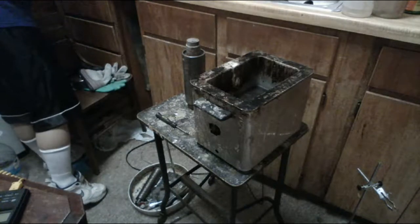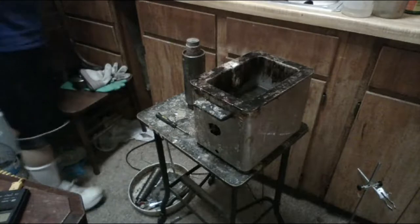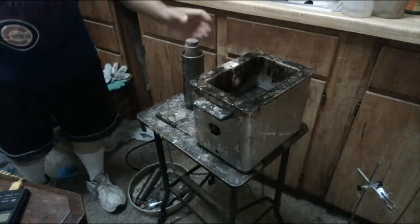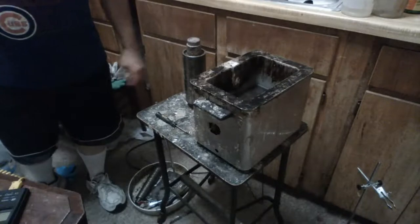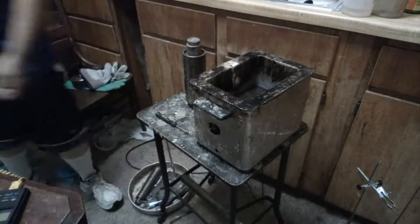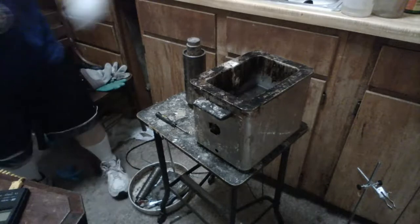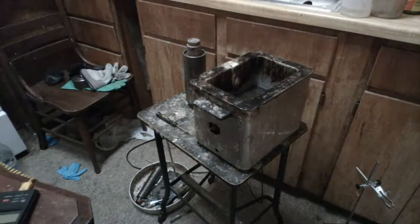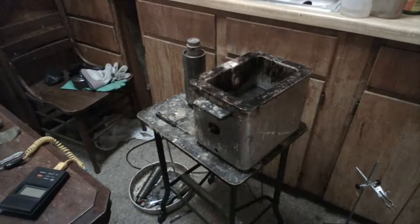We're going to give it about 20 minutes. Sometimes this will actually fall off of it. We also have to check to make sure it doesn't bind on there. But there it is. It looks like a successful casting. I don't see, at this point, any dendrites or stars and streaks, but we won't know that until it actually comes out of the mold. But you can watch it if you want and see what happens. It's taken an hour and 2 minutes, basically, for the whole molding process, or for this video, at least.